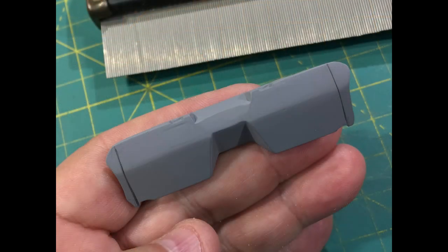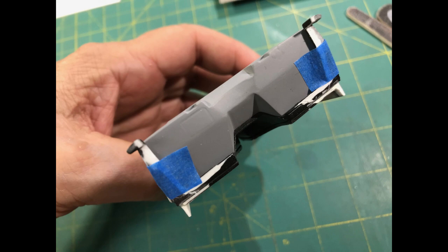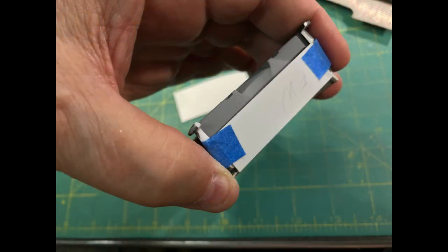Next up was the firewall. I really wasn't all that happy with the shape of the firewall. You can see where I marked the sides — I cut those off because the inside fender wells are going to be running right down along there. And where the transmission hump is, instead of it kicking back as it does — you see how it slopes backward on the bottom back into the chassis — I want to maintain that for the interior but have it come straight down, more like a box. So I took some 20 thousandths, measured my depth up to the crease where it starts off. You can see where I've got it taped on — it'll be more straight down, giving it that box shape. Then I'll cut the transmission tunnel right back into it. Coming along really, really nicely.